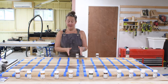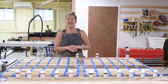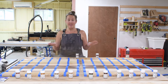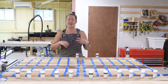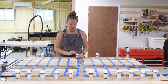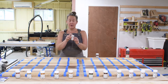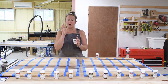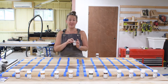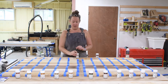Next we've got the buff and finish. The buff and finish comes in so many different stain colors, and I actually did a video on this exact test with all the different stain colors on different species of wood, so I'll put a link to that video here as well. For the pre-sealer for the buff and finish, I'm going to be using the natural stain color. You do have to have a sealer underneath the buff and finish — it's almost exactly like the finish, just a slightly different formula.